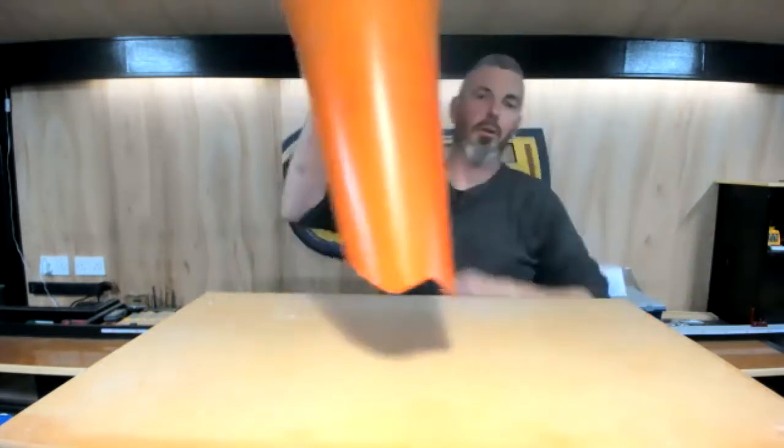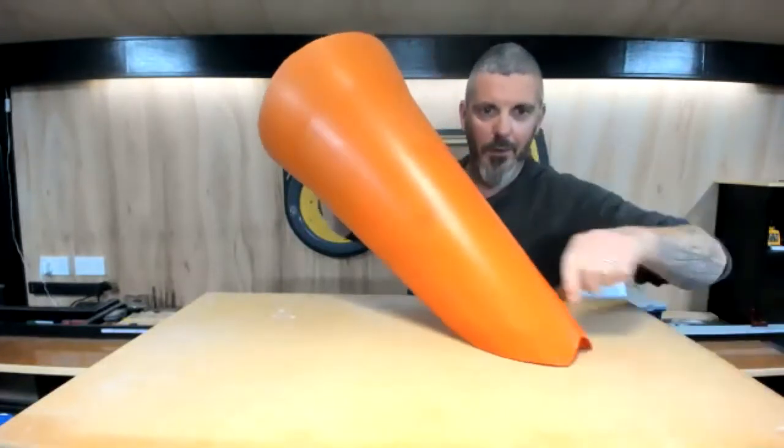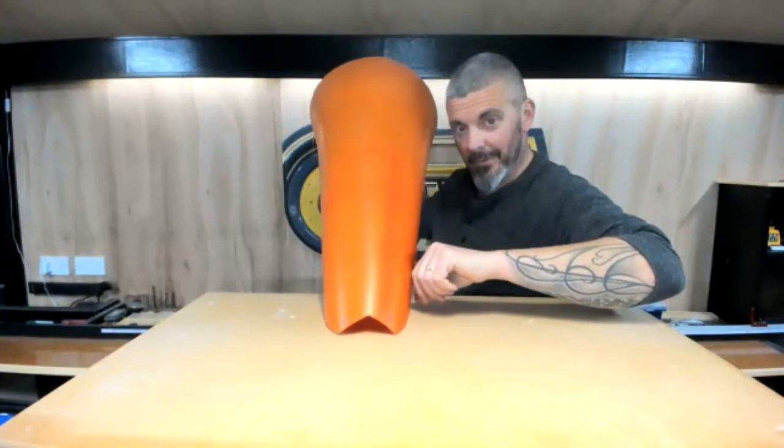So when you are caulking, you can see what's happening: as you're pushing it out, you're leaving a trail of caulk in that shape. It eliminates so many little problems with build up, because you're doing two things at one time, moving and squeezing. Getting that dance right is bloody tricky, but this is an absolute game changer. Take that extra couple of seconds, get your knife and go tick, tick, create a little V at the tip, and it just gives that caulk an escape, a flow.